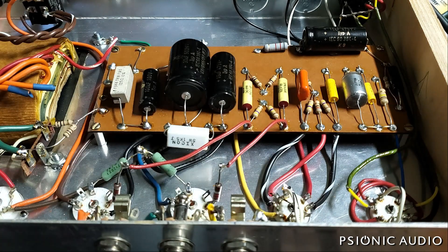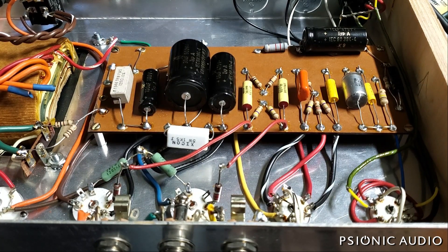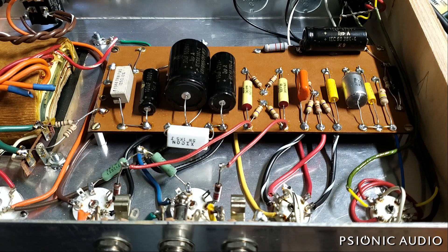The rest of it goes to a fairly standard long tail pair phase inverter, though he does have 470k plate resistors, which is a little bit unusual. And a 56k tail, which seems to be fighting each other. It seems to me that if you wanted to get more gain out of it, 470k plates is kind of extreme. I might have lowered that tail resistor from 56k to something a little hotter. I played around with that a little bit, but the amp is stable and I don't have any issues with anything he did.